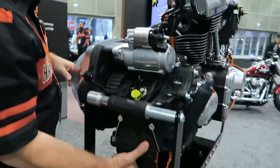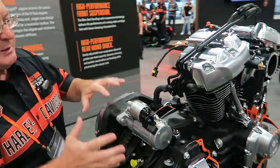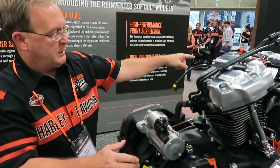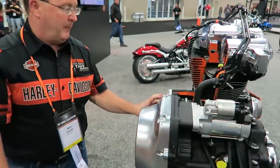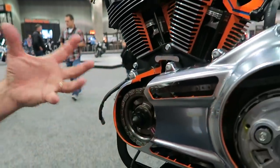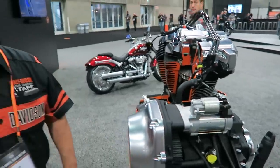The gear cluster of the transmission is effectively the same part and drive, but it is a different transmission case. There are two different cases for the standard and the wide rear tire — the Fat Boy and the Breakout get the wide transmission, shifted over. The inner primary cover is different between the narrow and the wide. The compensator is dedicated to the standard and wide transmission respectively. The primary chain has moved outboard, so the primary and transmission case are different with the wider bikes — that being the Fat Boy and the Breakout.